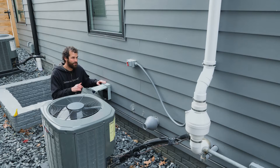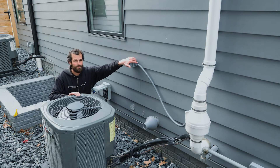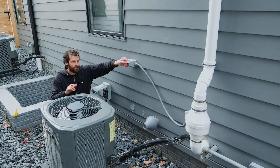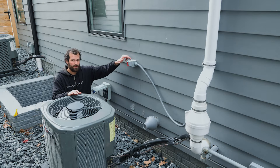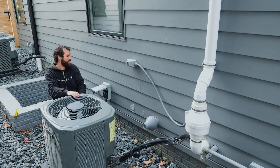This is one thing that's commonly overlooked. If you look carefully around the perimeter — sides and top of this radon disconnect switch — it has been weather sealed. The cover is outdoor rated, the box is outdoor rated, it is properly sealed. I like everything about it. The perimeter of the box has been sealed with a durable outdoor-rated caulk and it's in good shape.